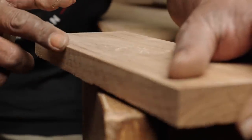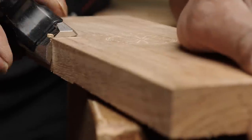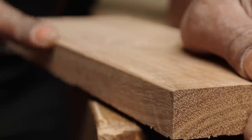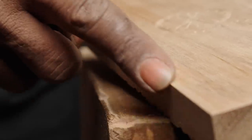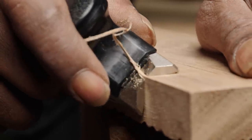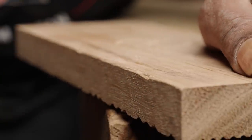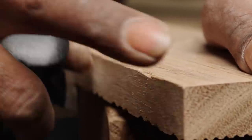Now if you wanted to increase the chamfer then I would go to the 1 mil and I'll use the 1 mil grip type here to show you how that one works. You can see that edge now as compared to the other edge which hasn't been done. This is what I mean about the 1 mil — you can see it digs out a little bit there. That's why I prefer to go with the 0.6 mil first, or even the 0.3, and if everything goes well with that then I'll go with the 1 mil and clean it up.